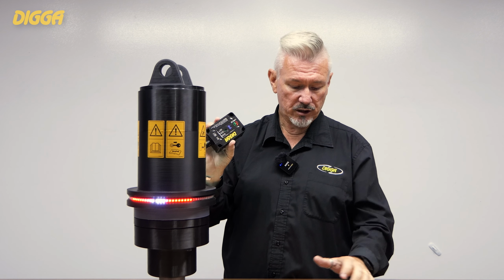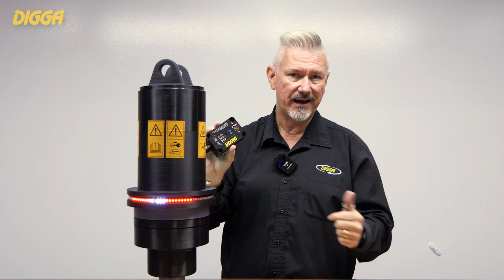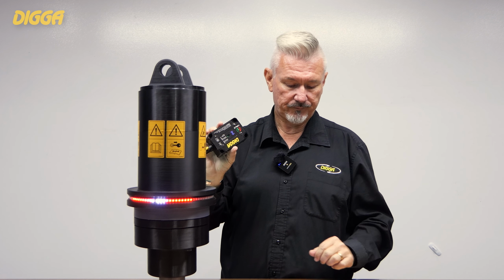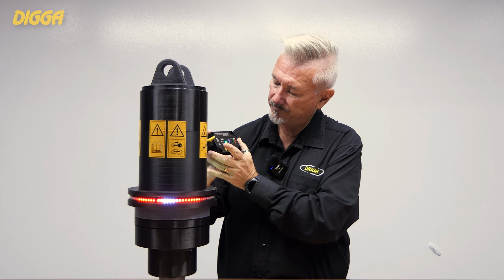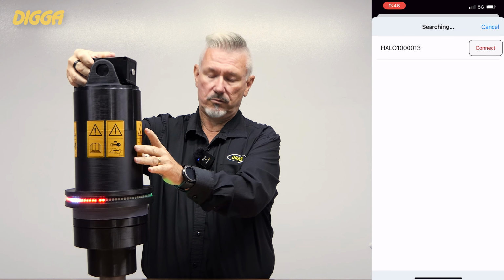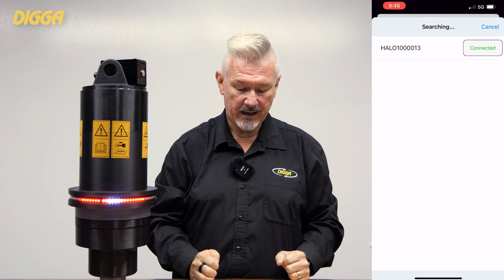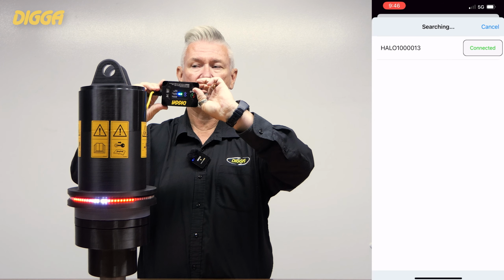So what we do is you go through, as you would download any app, download the Digga Halo app. Then we're going to open that up. We're going to turn the battery on. So it's a double tap. We've got a blue light that's going to be flashing. Then once we've got that, we're going to hit connect on our app. It's going to connect. Your blue light will then be steady. It's not flashing anymore.